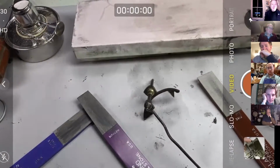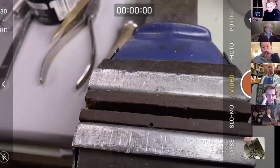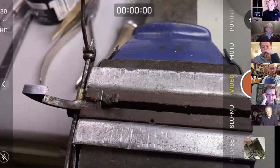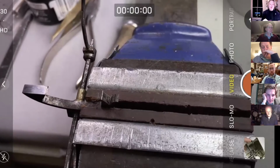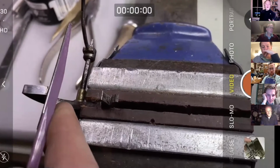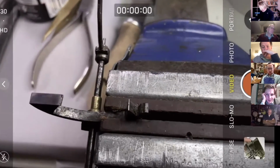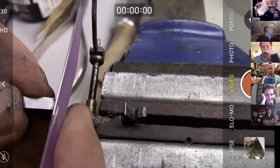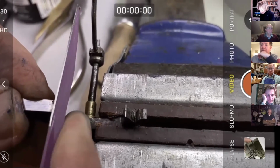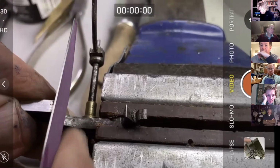And the beauty is this is absolutely one of the best cases where you would use a diamond file. Now, a bit like the flux on the thing, this is a demonstration, remember, I'd be very mindful of diamond dust getting into the clock. So everything needs to be really washed after. But for keeping away from that early original surface, you can see there, let's just move around a little bit. And this is where I want this diamond file, if you call it, or hone or something, to be really stiff. I don't know if you can see on the film, but the plastic bends and it is annoying. I bought the wrong product, basically.